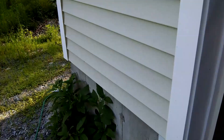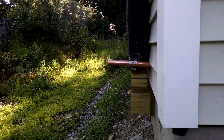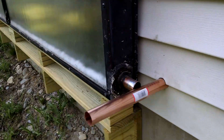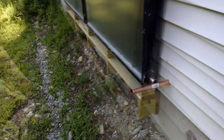Over on this side, you can see there is a pitch on it — you have to make sure that everything pitches inside so that it won't freeze. All the water is going to drain out of these panels and go inside; you can't leave any water out. Now we're going to put the fitting on.